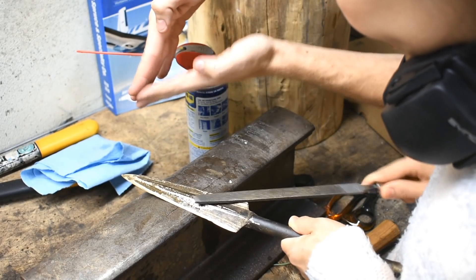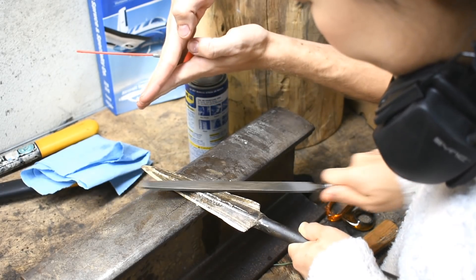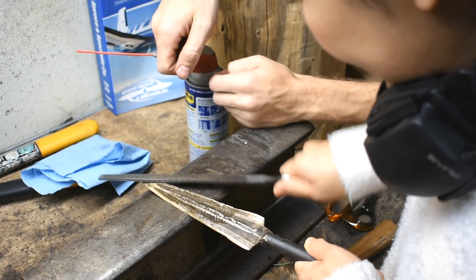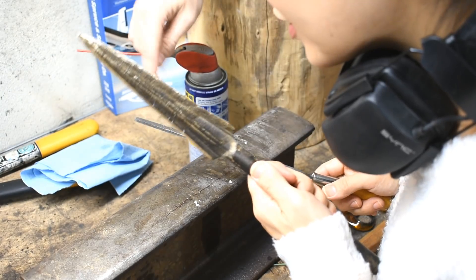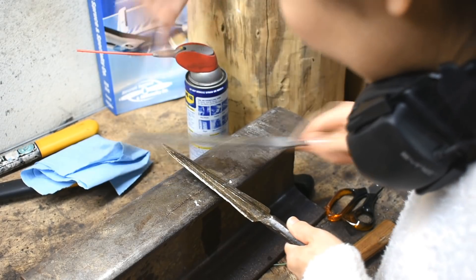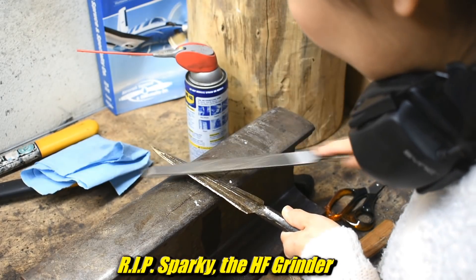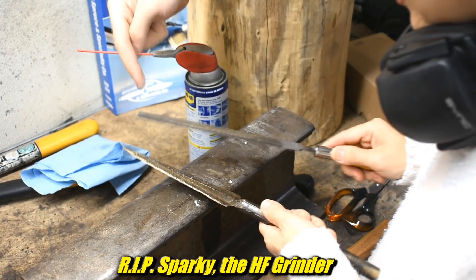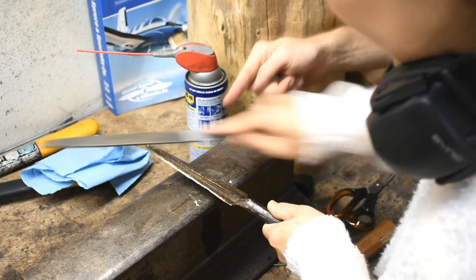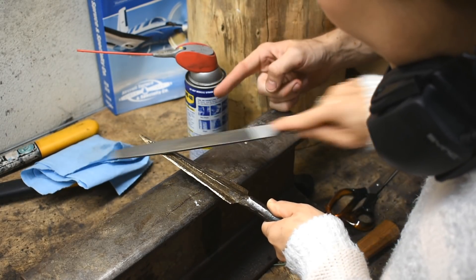It's not going to be as great for shaving or slicing through really thin stuff, but if you hit something and move, it'll still cut into it — it'll definitely cut paper. The reason we're using a file and not an angle grinder, which is one of my favorite ways to grind stuff, is because the angle grinder heats up whatever you're grinding. You don't want this heating up. Work hardening — bashing it with a hammer makes it harder. Heating it up once it's work hardened softens it again. So we want to do all of this at cold temperatures.